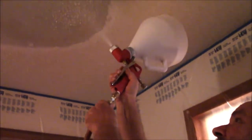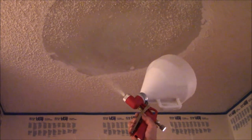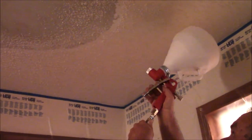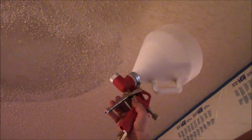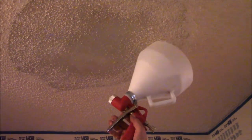I have a small compressor — it would be better if it were bigger, but I get by with it. You can see I'm just spraying it up onto the ceiling. If I had a bigger compressor I wouldn't be doing it in bursts, but I have to let the pressure build up with this small compressor to get the desired volume of air to push the texture and make it stick to the ceiling.